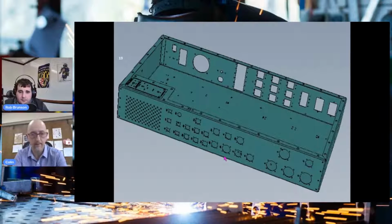So with 685 dimensions, if you have to do a PPAP with that, you could be talking about spending 3 or 4 days just doing a PPAP. Right. And that's an enormous time impact. Oh yeah. So if you don't need it, then why do you have it on there? These are things to think about from the design intent.